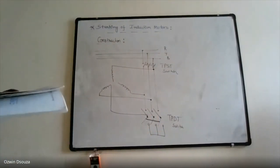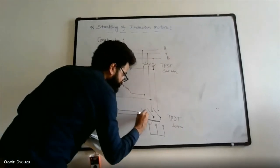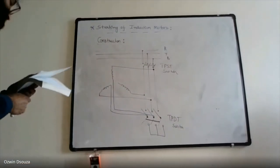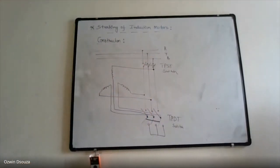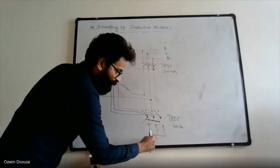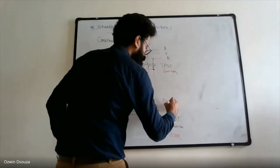Connected here, and then you have the second one. It is connected to the center terminal, and then you have the third. The third one is connected to the last terminal. Yes, here. So basically, the winding gets connected either in star, you can see that, right? A common node you have created in the downward direction. So this is your star connection, and the opposite one gives you delta